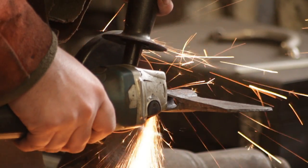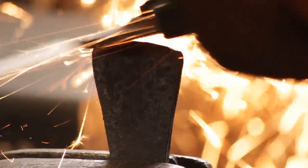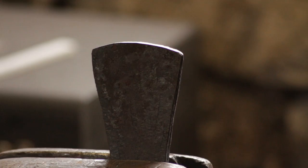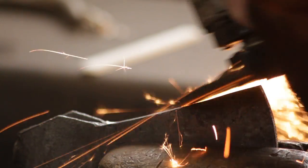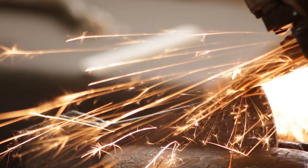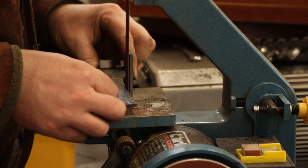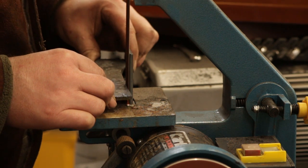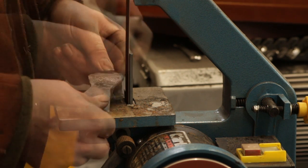So I cut the axe head off the bar and shape the edge. This will have a carp's mouth which will be quite tight, but I'll just keep grinding until I get to clean steel. Address the outer edges a bit — if you forge this quite cleanly you will only literally need to clean this up rather than grinding it to shape. I'll clean out the grinder marks on my nice new Clarke finisher. I just wanted to test what using a vertical platen was like — very good, I've used it quite a lot since I got it.